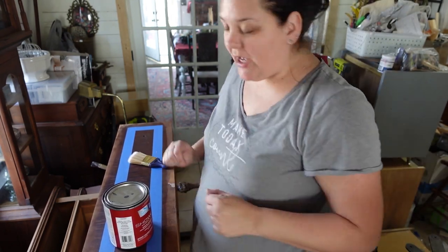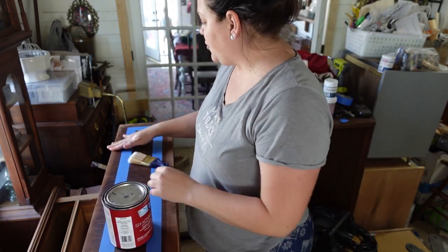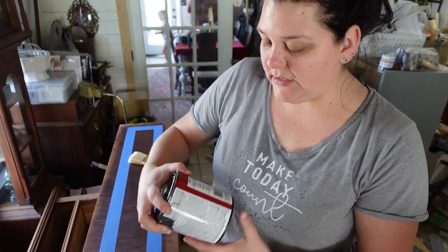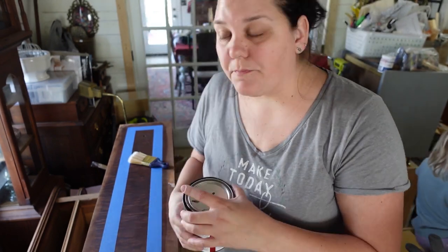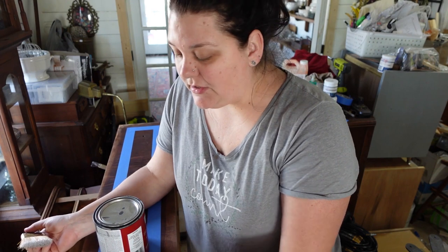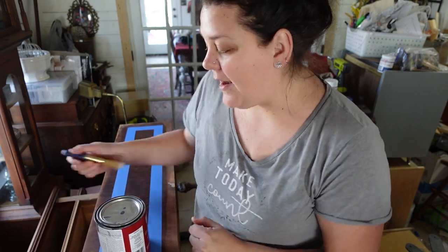So I'm working on this drawer here and I have taped it off. My plan is to just tape it off and paint, and I'm not going to worry about the veneer problems on the edges because I tried filling them in with bondo, but the veneer is so thin that when I sanded it down it just dissipated. What probably should have happened was I should have just ripped all of the veneer off of this piece. But then much of it would have been destroyed doing that, so I'm doing what I can with what I've got. I have this paint that I'm going to use — it is a very dark gray, Iron Ore. That's what I'm going to paint around the edges, and this is my plan for the whole piece: maintain as much of the good veneer as I can and paint the rest to cover it up.